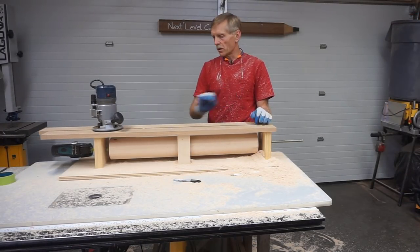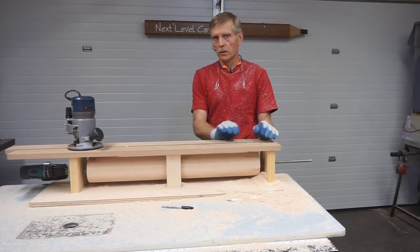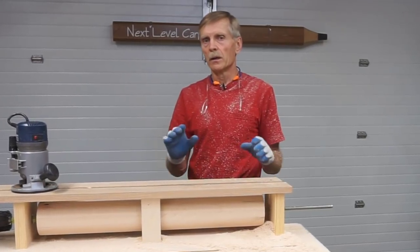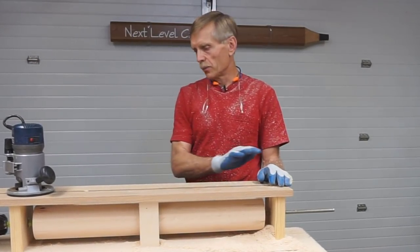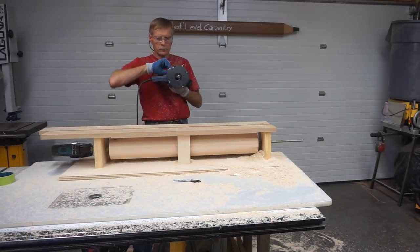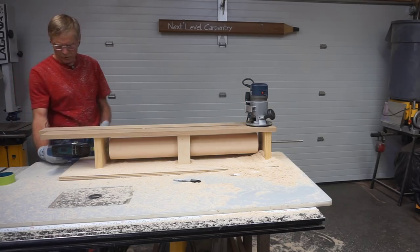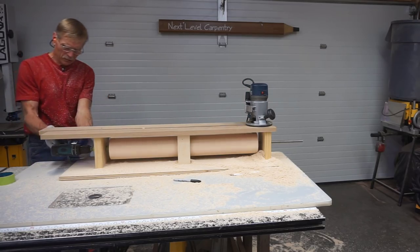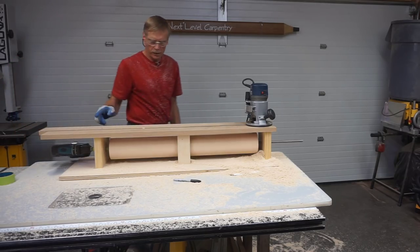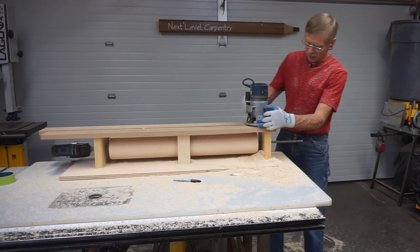So I'm going to take one more whisker off the whole thing in one final pass of like a 64th of an inch with a real slow feed rate to get it nice and true, where I'll be able to pick it up from there with a sanding block to put the final smooth pass on this turning. I sped the drill up a notch again for that nice, smooth final pass.